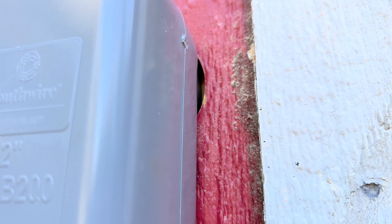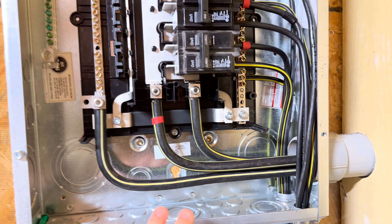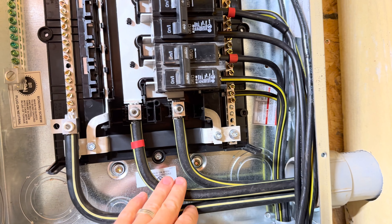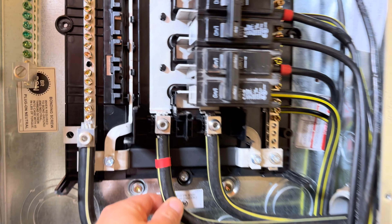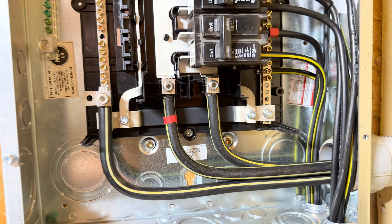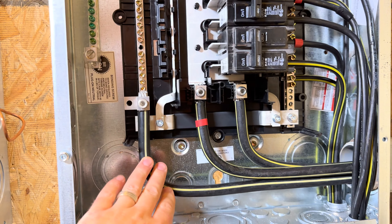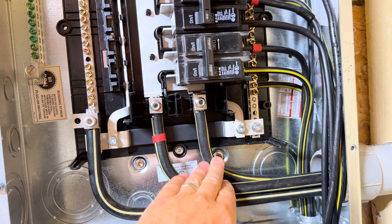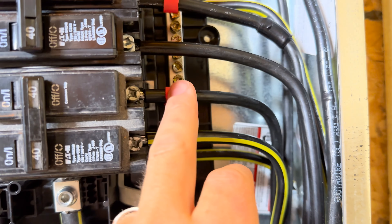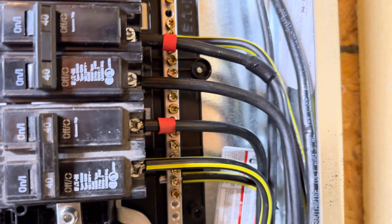I didn't have the exact size, so this is a little sloppy, but that's okay because I've got some caulking that's going to fill it up real nice. So I've really loved the way that this looks now with these big wires coming in here. That one seems a little loose — it's got some extra flex to it that I don't really love, but that's all right. So we've got our neutral, we've got L1, and then L2. I've got this little piece of heat shrink right here that's going to indicate L2. I've also put some heat shrink here and some heat shrink there for L1.